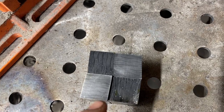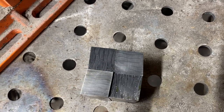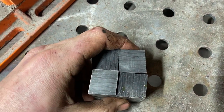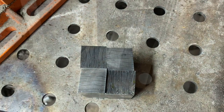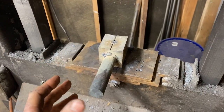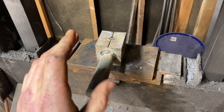We've got everything cleaned up and cut up. I did a little bit of etching on the ends just to kind of see where the layers were. I've got them stacked up alternating how I need them. We'll tack this together, weld the work stick back on, and go from there. This is a tricky forge weld to pull off because you have seams going in both directions.